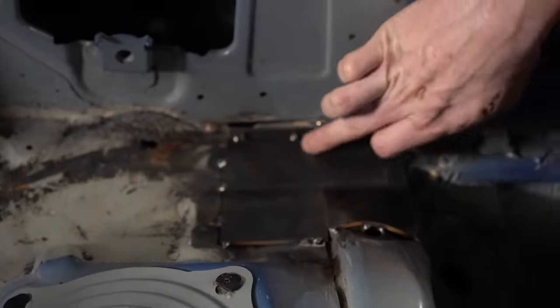That means you're gonna have to do a bend, then you're gonna have to slide the tube through and rotate it and then do another bend. And then you'll have to do probably one more rotation for your third bend in order to get the contour of the chassis. The car is narrower on the roof than it is at the base quite a bit, probably 10 inches narrower here than it is down here. And that requires a lot of change in direction.